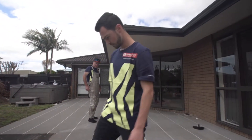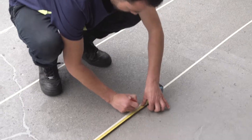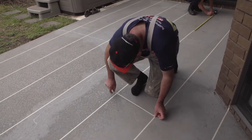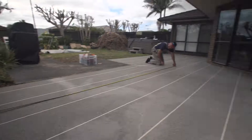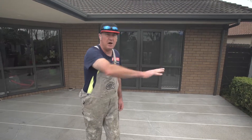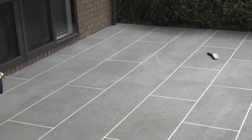The design they want on this deck is a 500 by 1 meter tile. Dan's measuring out the length of our tiles — we've started from our center point and going along 1 meter intervals along our tape. We're going to apply the Wick Color It over the whole surface and then pull the tape out, which will give us our defined tile look.